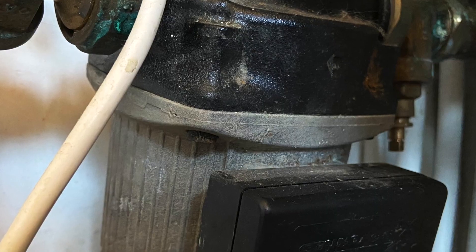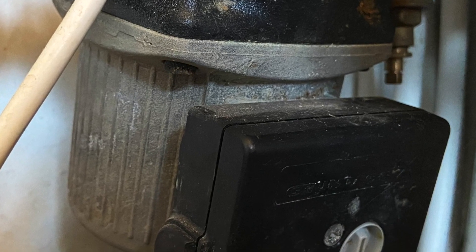So there are only three things that can ultimately cause that. The first one is the actual pump inside our utility room, which I was able to figure out was okay. There's a little float inside the air source heat pump which we can't really test, and the third one is a blockage. After checking out two of the three causes we quickly determined that there was a blockage in our pipework.